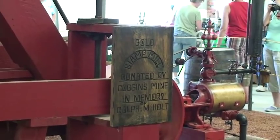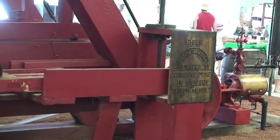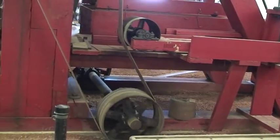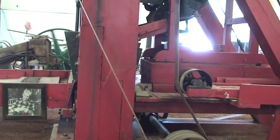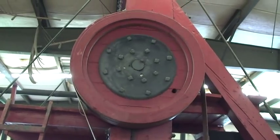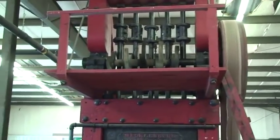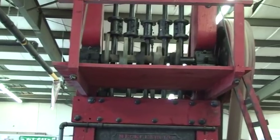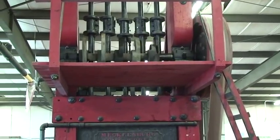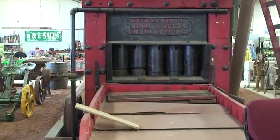That's going to take a lot of horsepower to press rocks and pulverize them in the mill. So the gearing we have off of the engine is to drive a small wheel, belt drive, up to a big one — and there we develop our horsepower. Now from our big wheel we're going to drive a camshaft, and those cams when this is engaged are going to lift those pistons up and down and pulverize the rock right down here in the stamp.